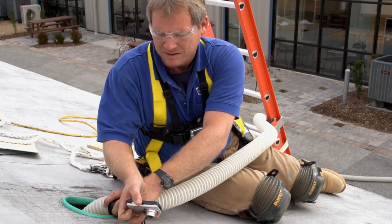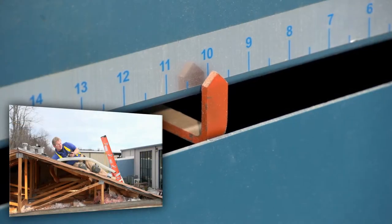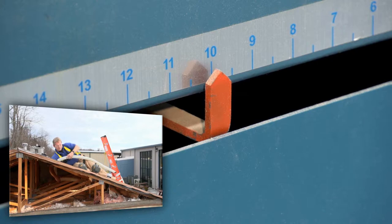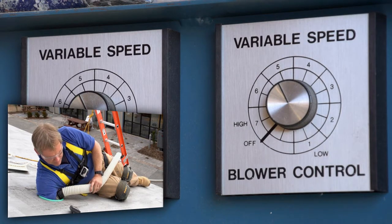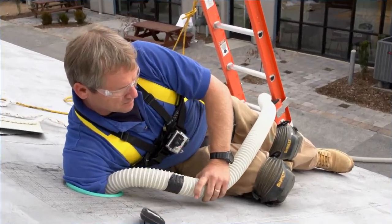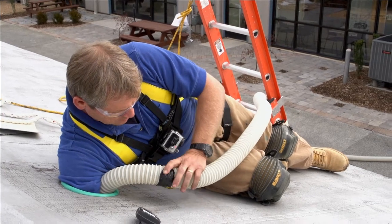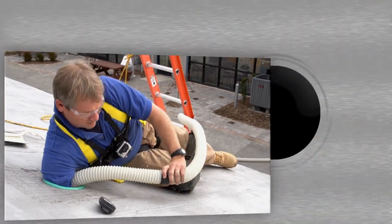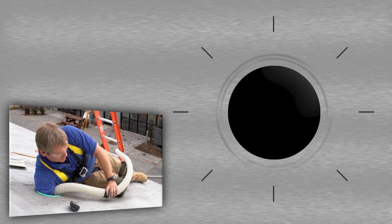The technician may now begin the roof cavity insulation installation. The machine should be set up to blow to pressure but not to dense pack. A sample setup would mimic blowing loose fill in the attic, only with a little more pressure. Remember, equipment can vary, so be sure to check manufacturer's specifications. As you blow insulation, draw the hose back towards the hole slowly. When you have reached the hole, stop the machine and repeat the previous process. Do all of this in a clock pattern, working all the way around the circle until you have filled the cavity.